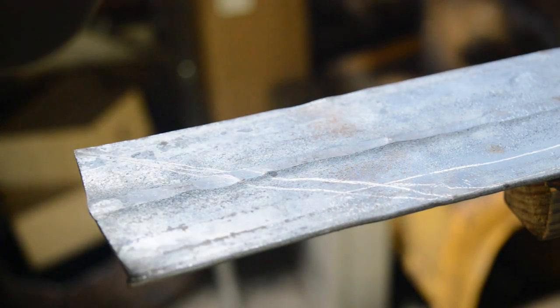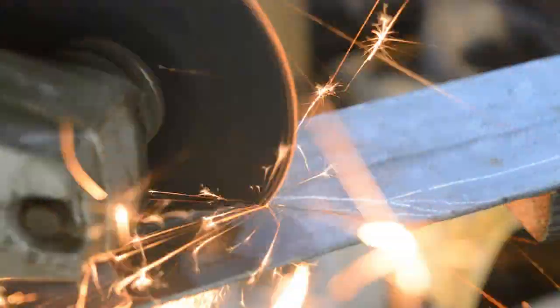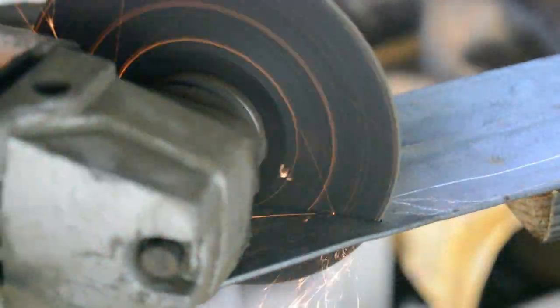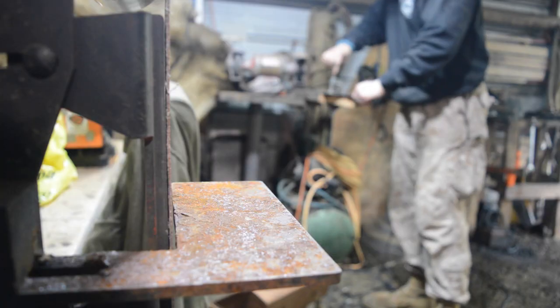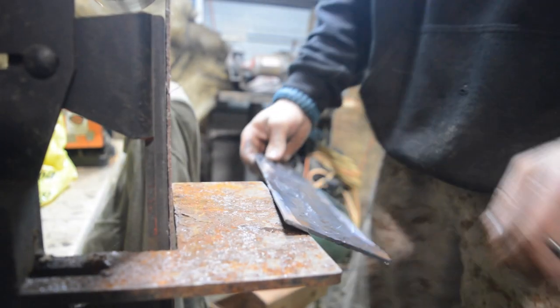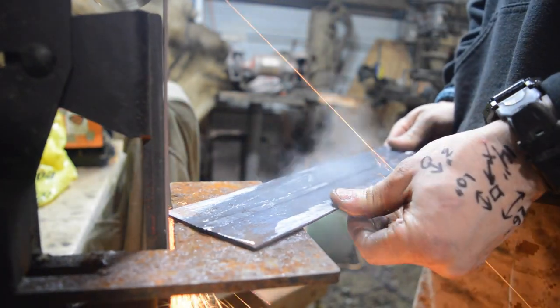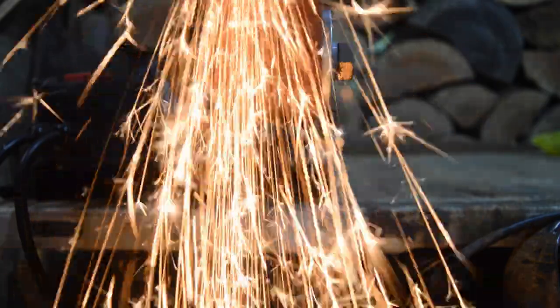Now that this has had a rough and dirty thermal cycle, I'm going to cut a Tanto tip, or something similar to a Tanto tip. I'm just going to knock a chunk out, and then grind it to its actual tip. This is just an easy way to remove material so I don't have to spend that extra time on the grinder belt. I drew out a basic shape on this piece of metal just with some machinist chalk, then I'll just grind it to the general shape.